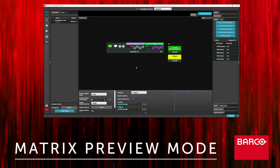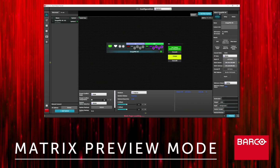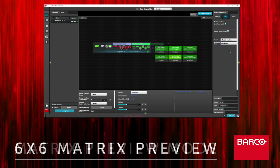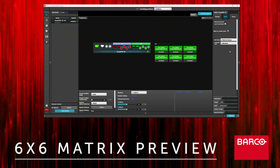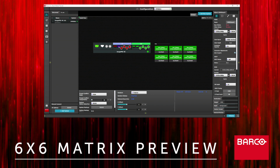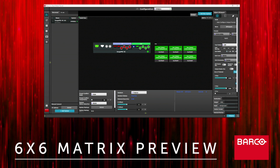So let's take a look at Matrix Mode. You can switch to Matrix Mode from the front panel or under the Setup button in the Adjust tab. In Matrix Mode, the ImagePro 4K acts just like a scaling matrix switcher. Take a look at this example of a 6x6 HD matrix. Here you can configure your inputs or outputs and switch between them just like any other EventMaster device.